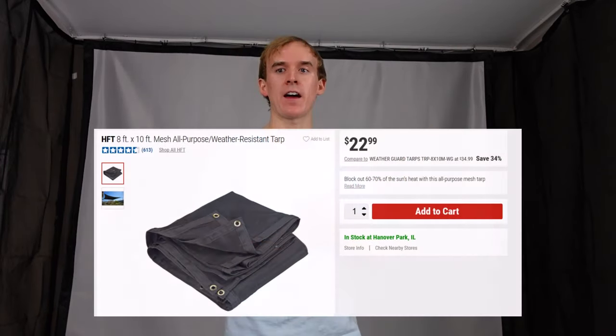For those that want an immersive golf experience, the projector is definitely the way to go. This was the part of the build where I made the biggest mistakes. I would highly recommend using a projector-centric website to calculate the throw distances and get specifications. The second major mistake I made was not calculating the throw distances right the first time — I got my old projector mounted and wired up only to have to tear it down, patch up the holes, and order another one. The third major mistake was not taking enough time to find the studs in the ceiling when hanging the projector, so one of the holes hit a stud and I wasn't able to get the plastic cap in all the way.